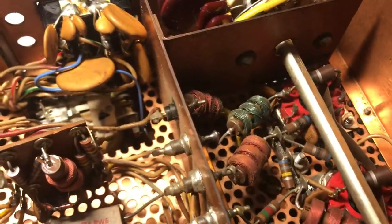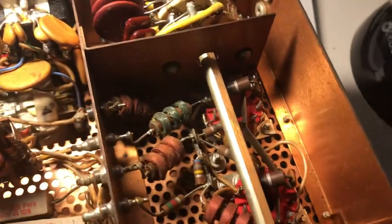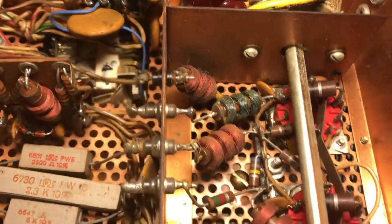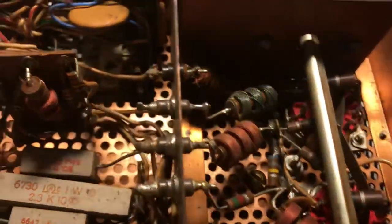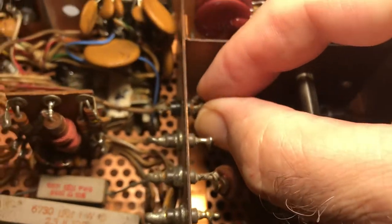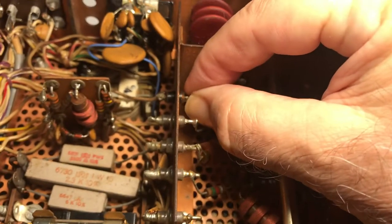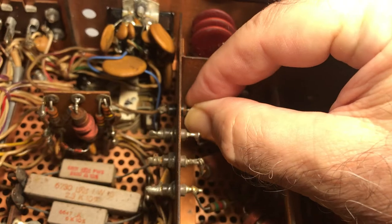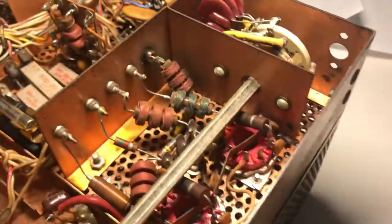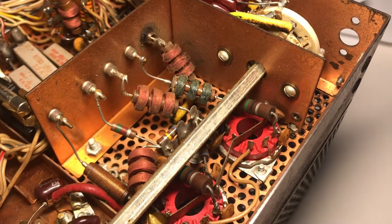I did find where the finals are fed on the bottom with high voltage — there are probably some issues there. You can see this feed-through is darkened here and it's probably loose too. Yeah, this feed-through is loose — see how that wiggles. That feed-through looks bad. You can see how it's been darkened on that side — it looks like it's been arcing or something. That's something I need to replace. I recall doing this on a Swan 500 once.